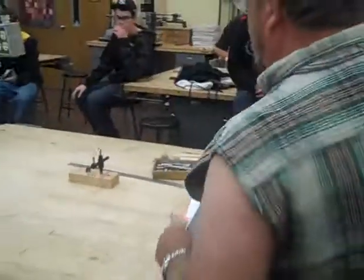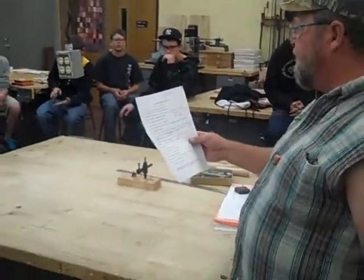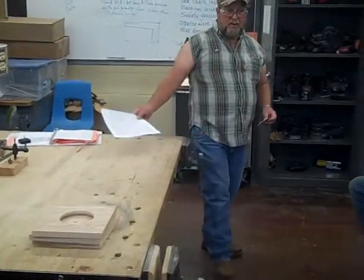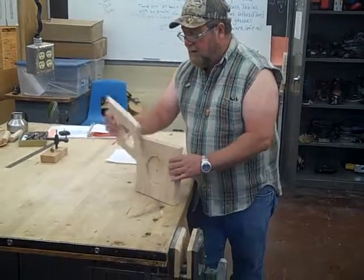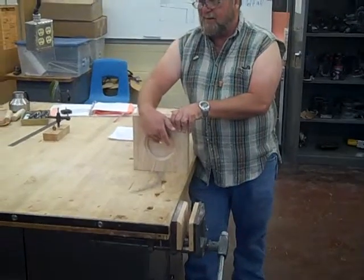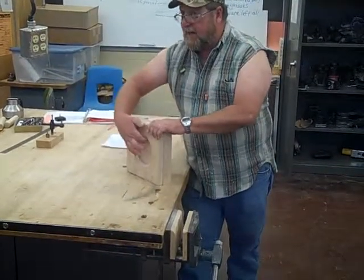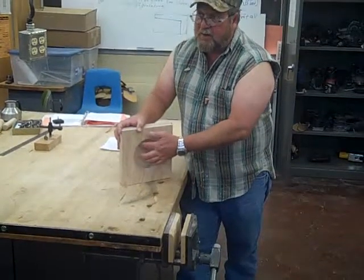This is a little bit of final preparation before we glue. Step 11 says sand with 120, 150 — and I would add 220 as well. It says face board and second board. The reason we do that is when we glue this together, we're not going to be able to sand this face right here, because you can't sand inside there and get all the way to the edge. You also won't be able to sand the inside ring on the face board, because then you'd be scratching board number two by going across the grain.